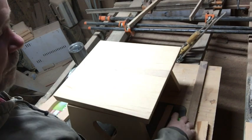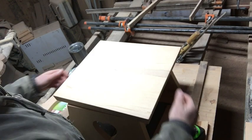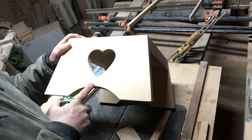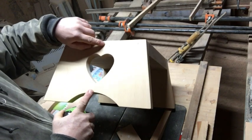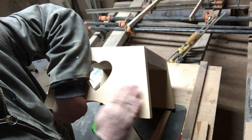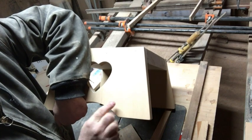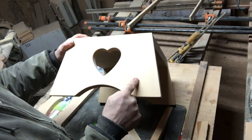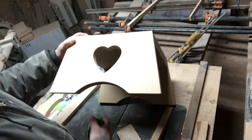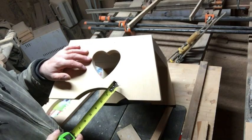I have to measure on the long face between this point and this point to get my total length, because it'd be too short from point to point since these are cut at a 10-degree angle. We started at 15 and a quarter and by the time I got done sanding it was 15 and 3/16. So two boards at 7 inches by 15 and a quarter - or 15 and 3/16, it really doesn't matter. We're going to have four of these boards total.